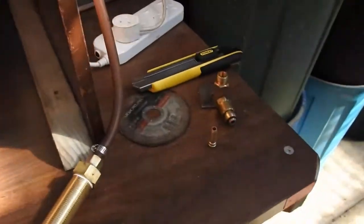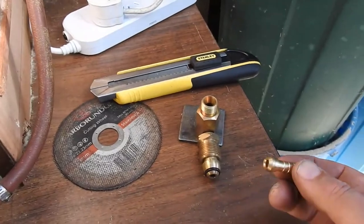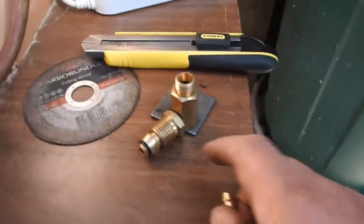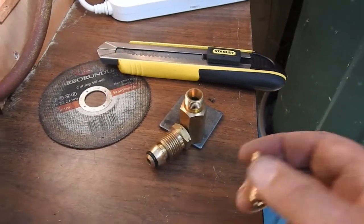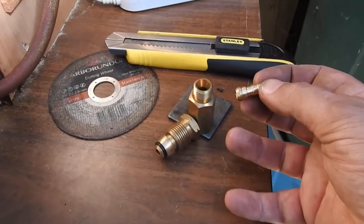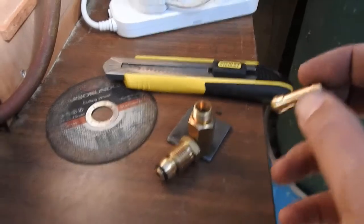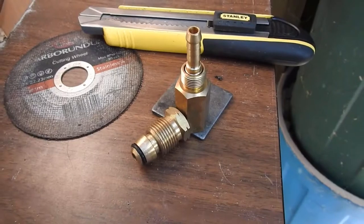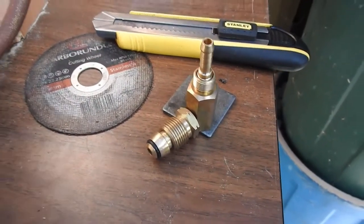It's common practice to rip the valves off those tanks in order to use them for compressors, but I've come up with a simpler way: get a store-bought adapter so you can connect to the gas bottle. Instead of fitting the usual burner pipes to it, you get a hose barb, put it in there, then use a mixture of solder to bind them together and create this assembly.